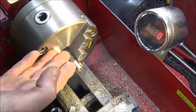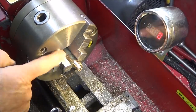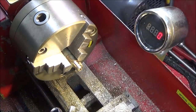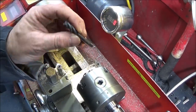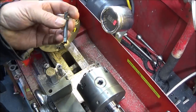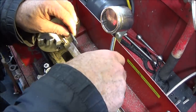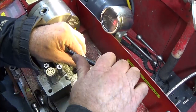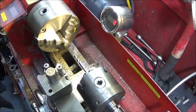And if you have a short piece of bar in there, drill right the way through, but if not, drill quite deep so that you know that when you send the tap down, it's not going to bottom out at the end. So next I have an HSS 8 mm spiral tap, and I think these are one of the best taps you can actually get, and I'll put a link below to them. And I'm using my 80 mm self-centering four-jaw chuck, and that holds on the square of the tap and prevents it spinning.